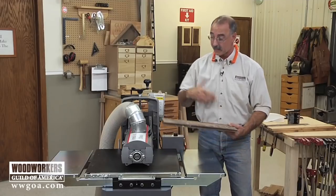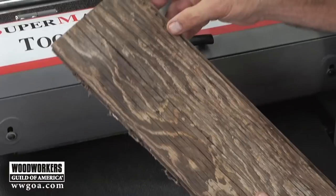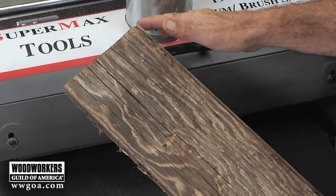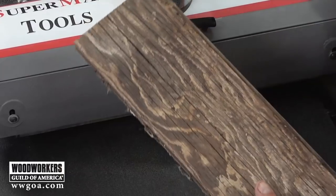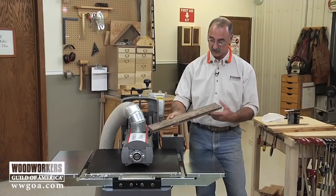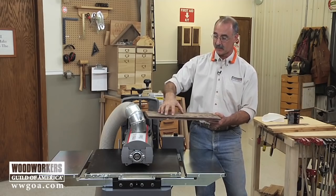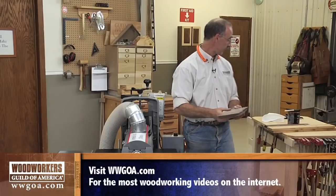With the wire wheel set up, think about what's going on here. We've got those stiff fingers, those wires reaching down into the material, so there's a lot of variables. We can change the RPM of the head, we can change the speed on the conveyor, we can change our depth of penetration - all of that's going to affect the outcome. But you can see on this one already it's a lot cleaner than it was when it came in. As I feel it, I can really feel the texture difference.